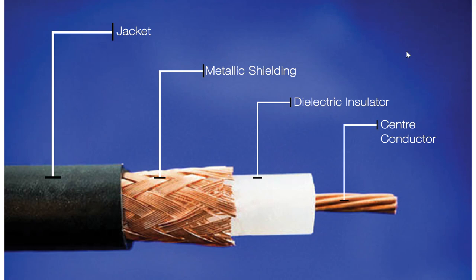And, of course, there are some people who might be tempted to use cable-type coaxial cables that could go sometimes as high as 300 ohms impedance. Now, that mismatch is really big, and that might start actually degrading your reception. But overall, even if there's a little mismatch, 75 instead of 50, the type of coaxial cable that you use is not going to have too much of an impact on reception below 30 megahertz, because the loss at those frequencies is very low, once again, in reception.